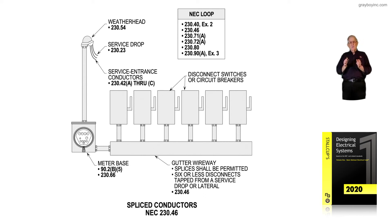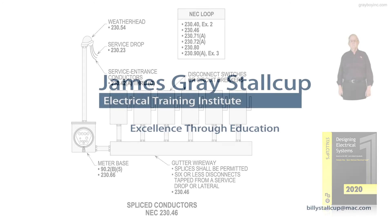They are grouped, as you see there, complying with 230.72(A). We apply 230.90(A), exceptions 1, 2, and 3, and then 230.80 — we keep the amp ratings of the disconnects and protect the ampacity of the conductors. This deals with sections we would need to review when making an installation as shown in illustration 6-22, dealing with spliced conductors from the main service conductors to each individual disconnect, that's two to six.